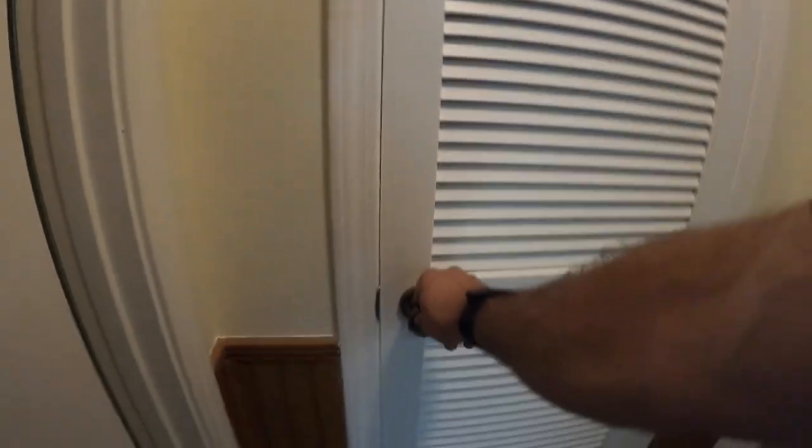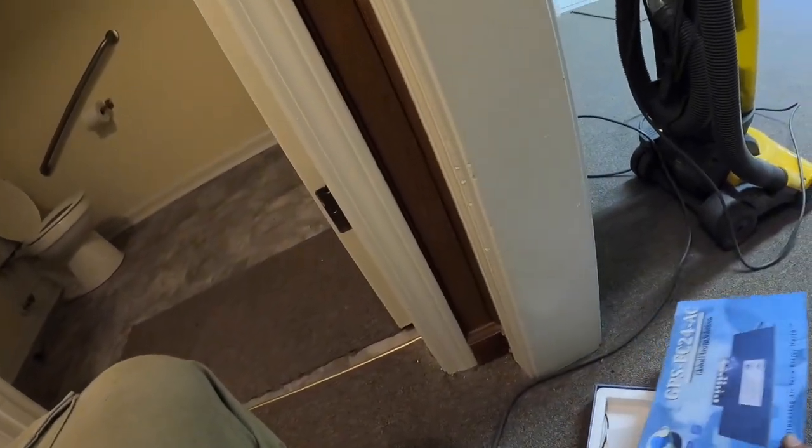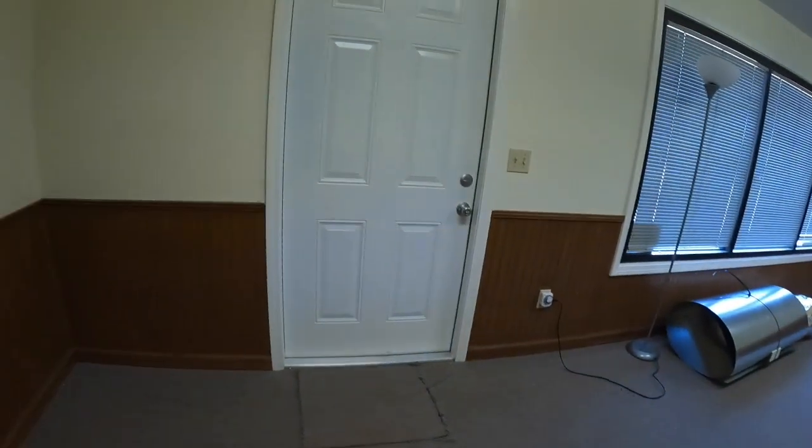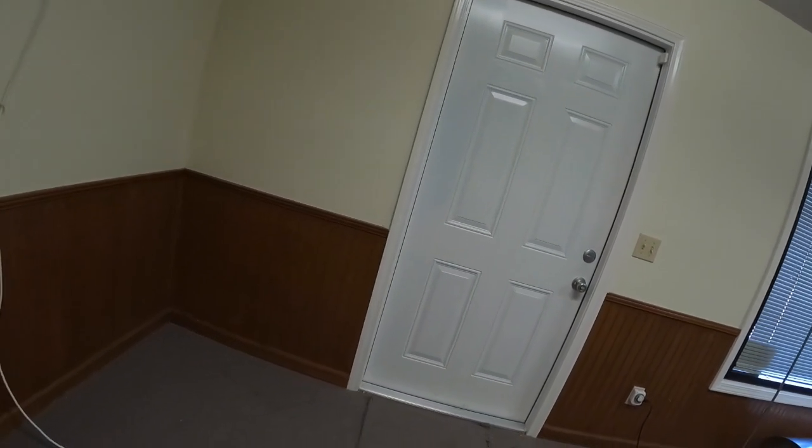Alright, and now what we're going to do is leave the fans in the on position until we come back or the owner comes by. That way they can help take some of the smell out of here. The vacant building smell is what we'll call it. So it's set to cool. We're going to do fan on. Air set to 80. Want to keep the humidity low. This unit's pumping out some good air. We're going to leave the fan on. I'll set the temp to 78. Just heard the compressor kick off.